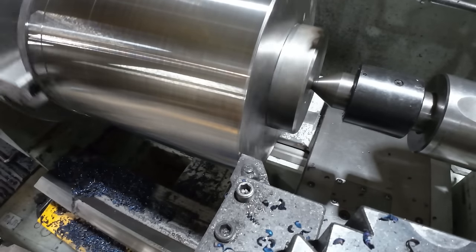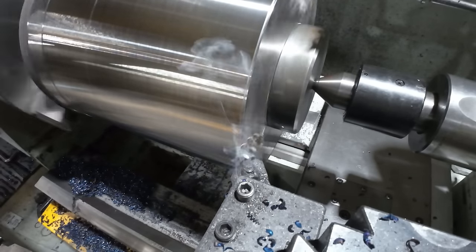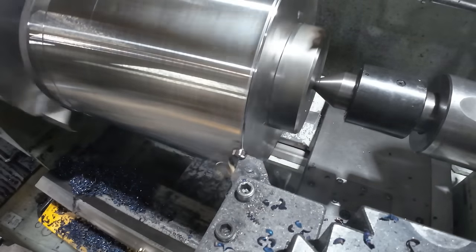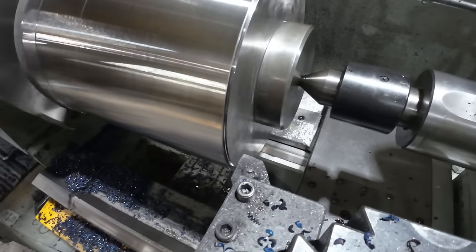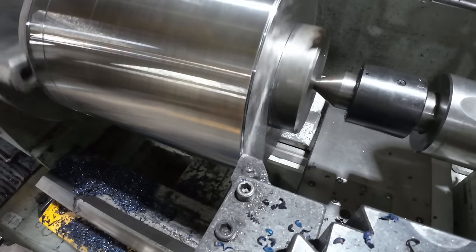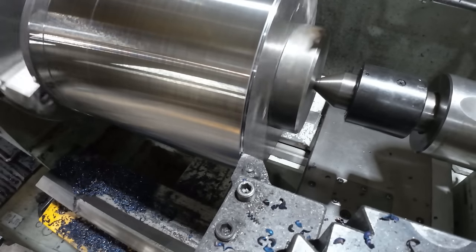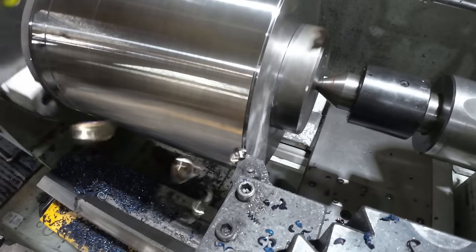All right, I slowed my feed rate down a little bit. We'll see how it does. And this, that might be too slow. 375 thousandths deep. Yep, we're just a little slow, so I'm gonna speed it up a little bit more. In my infinite caution, I went down to 7 thou per rev. I'm up to 10 now. Let's see if this makes a nicer chip. Much better.